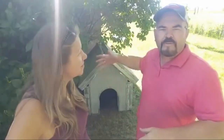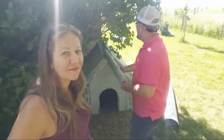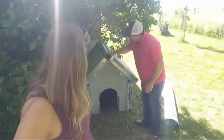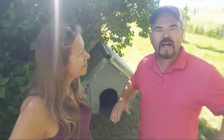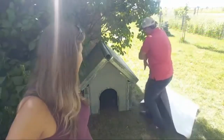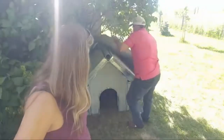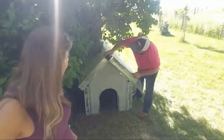The PVC roofing I used was salvaged out of a dumpster — a scrap off a commercial roofing job — so it didn't cost me anything. In winter I heat it with a heat lamp on an inline thermostat, set so if it gets below 50 degrees the lamp comes on, and it worked fabulously. In summer to cool it you just spray the thing down — we have about a five-mile-an-hour prevailing wind and as the water evaporates out of the wet cement it keeps the inside about 17 degrees cooler. I stretched the PVC roofing over the top, cut it to shape, and screwed it down in place.